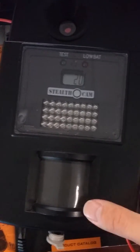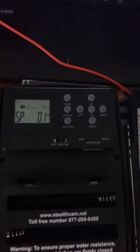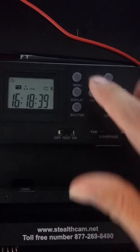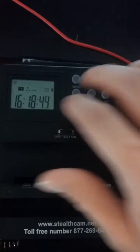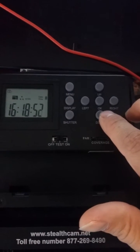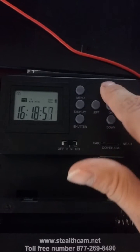This is how you set up an i540 IR camera. You open up this part of the camera, then turn the camera over into test mode — it's going to beep at you three times. Press the menu button; this is going to begin to blink right here. You can press right or left, which will allow you to go through either capture mode or video mode. In this case, we're just going to leave it on pictures.